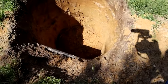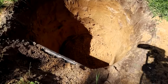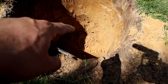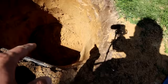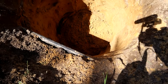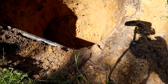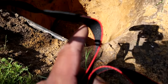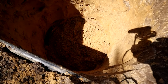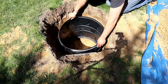After a good solid half an hour digging you can see what we have — that's about a 30-inch deep hole. Managed to fit that thing pretty well. The reason why I went a little bit deeper than necessary is two reasons. Number one, I want to throw some pea gravel in the bottom of this thing before we drop that in there. What that does is it improves the water-to-soil contact in terms of being able to percolate into the ground. I've always found that to be a better way of doing it rather than just leaving sand or soil on the bottom. Another reason — if you ever have to pump this out, it's nice to have that bed of pea gravel on the bottom so you're not dropping the pump right into the mud and sucking all that mud up into your pump.